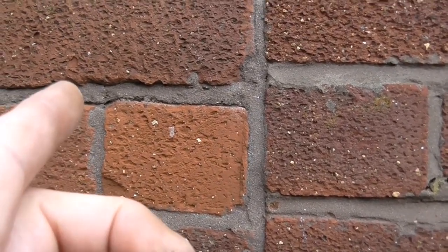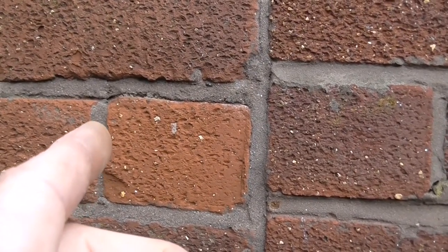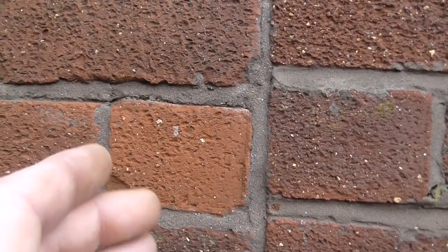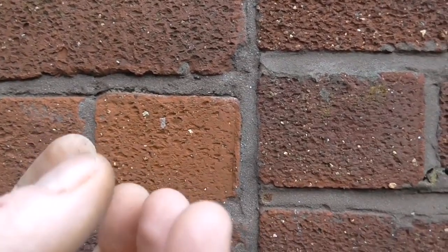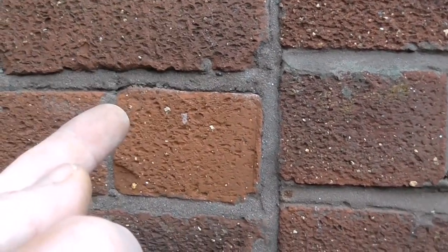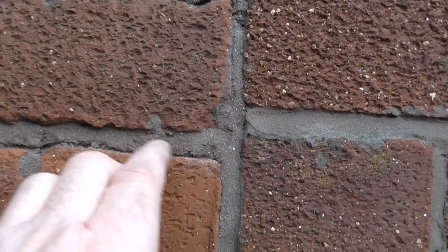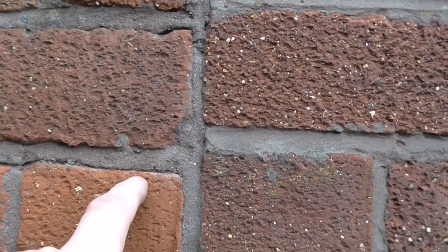The original is a lot harder — it'll be a stronger mix. If your mortar is failing, it's really down to two things: one, reworking it when it's gone beyond its workable state — on the mixer or the board it starts to dry, you play with it, it becomes crumbly, you rewet and rework it and put it in — and you can end up with this result.